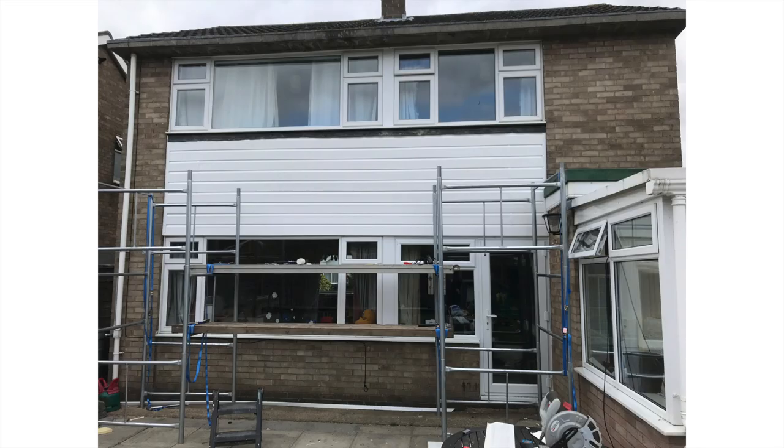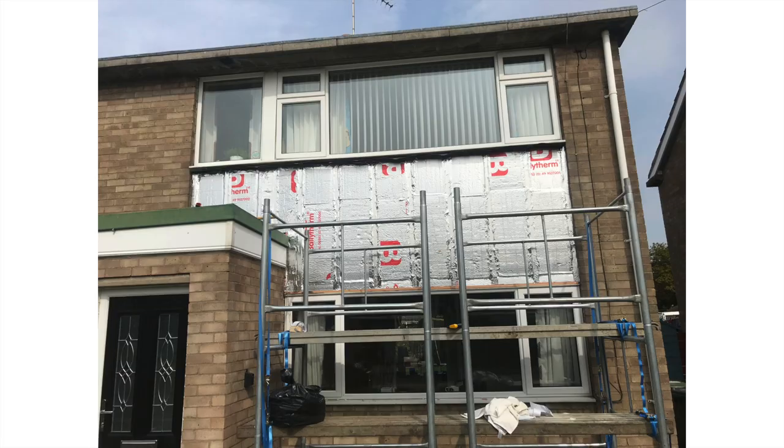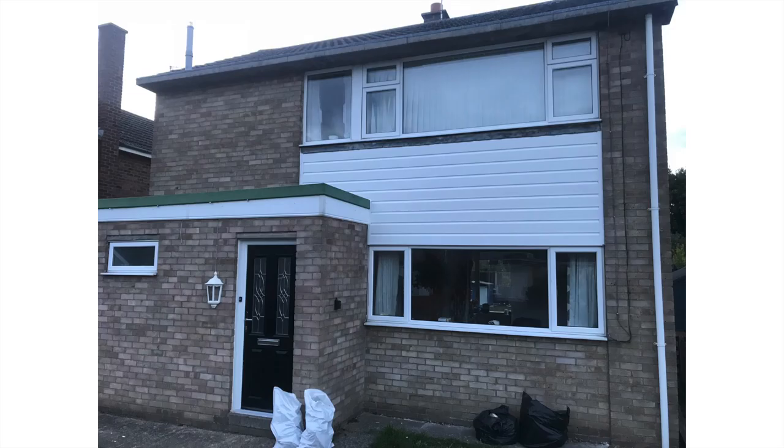The front of the house is the same, but I did find that this area was deeper — about 15 centimeters deep — which was interesting, but it wasn't a problem. You can just cut the foam to fill in all the little unusual gaps, and then you've got it insulated and just put the cladding over the top. Really straightforward job.